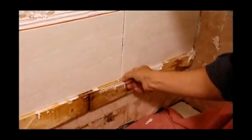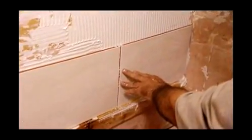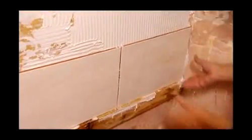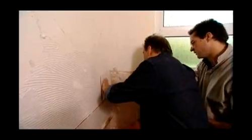Okay. Now, that's it, leave it out. Now you want to press that one in. That's it, bed it in a bit there. And the other one, you can see there's a bit of a lip there, so you just want to press that end harder than you press that end. To level out that? To level out that, that's right. And then you can drop it onto the tile.